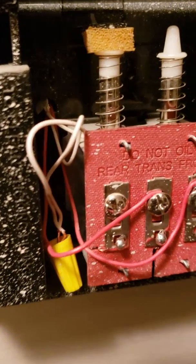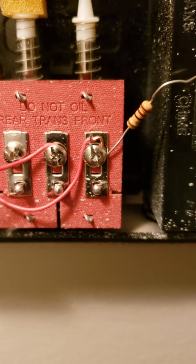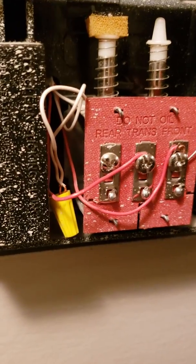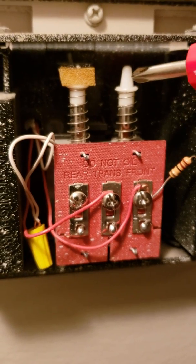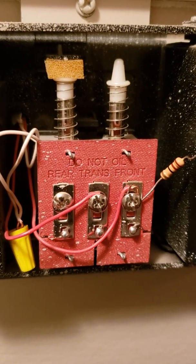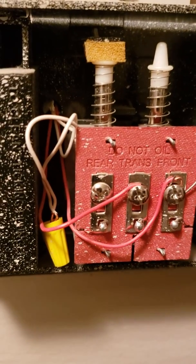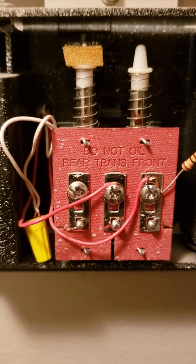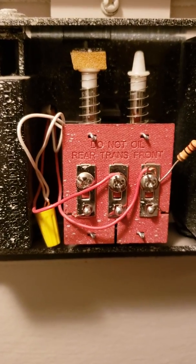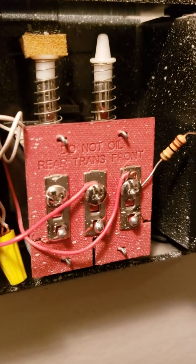It's my belief that what happens is the doorbell security camera is producing what is almost like a very light touch to the push button, and is sending electricity out to the coils. The coil is essentially in charge of dinging the chime, and what you hear — the buzzing — is just that emulation of a light press of a button.